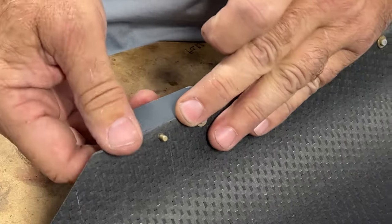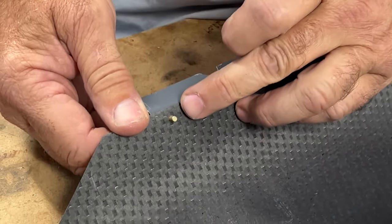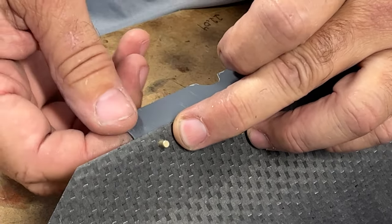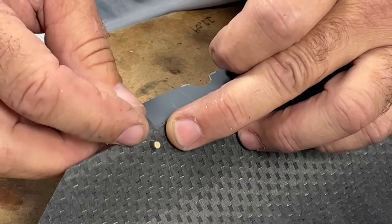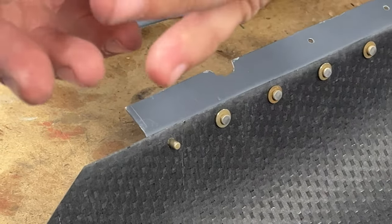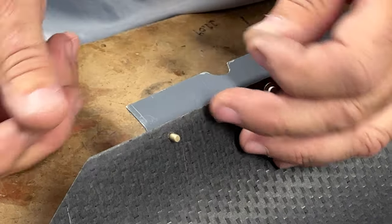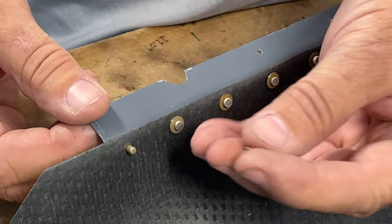The shop head — what we're going to buck — is against the carbon fiber. If you zoom in, you can see that if we set a rivet there, we're not going to have a real good mechanical bond to this piece of metal. As the rivet sets and expands, it'll really just expand and probably break the fiberglass.